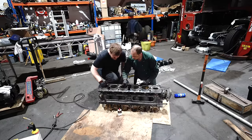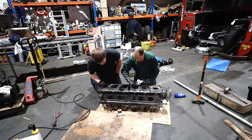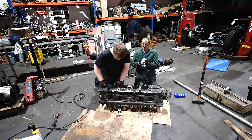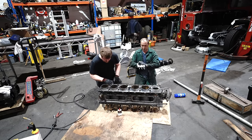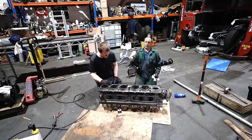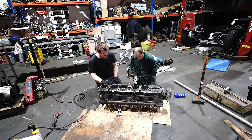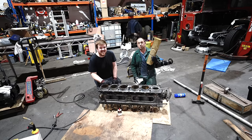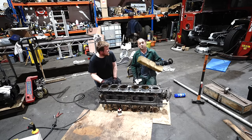There we go. Amazing how quickly they warm up. Six liners fitted without any of the proper engineering tools necessary. Just one fairly decent sized Birmingham screwdriver and, for you guys doing it at home, a piece of B&Q fence post. Just go in there and ask if you can buy a foot of it.